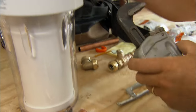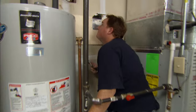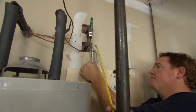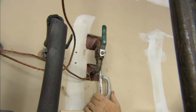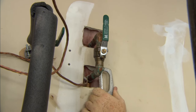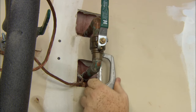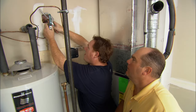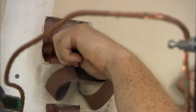I just need to hold back with a second wrench like so. Now, remember we've got the water off and I've opened the faucets inside. Take that hacksaw and cut right there at the back side of the elbow and right up there. Go ahead — careful, don't kink the blade. That'll give us a chance to start piping to our new filter. With the emery cloth, clean up both of those pipes for the first inch or so.